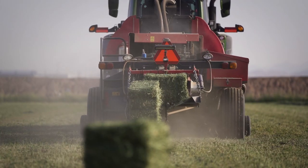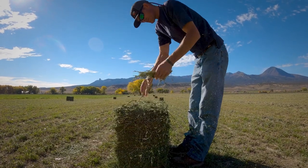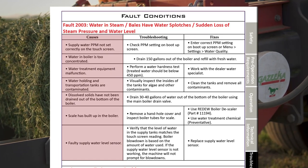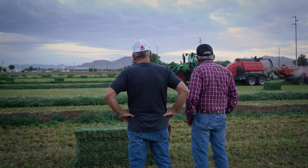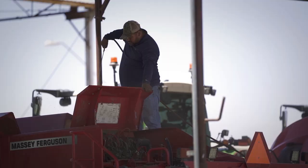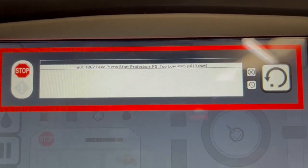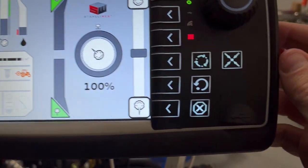Every so often, visually inspect your bales to ensure you are getting the desired effect. When freshly steamed bales come out of the baler, they will feel soft and spongy — don't worry, the bales firm up as they cool down and they stack excellently. If dark spots or wet flakes begin to appear in your bales, consult fault condition 20003 in the owner's manual to find the possible causes. Remember that you are responsible for how your bales turn out. When you are finished baling, perform the post-operation maintenance: purge steam through the baler hardware nozzles at 100%, then clean off the steamer and baler with compressed air. If a fault appears, look it up in the owner's manual and try to resolve the problem. Call your dealer if more expertise is required. Once a fault is resolved, reset the fault by pressing the reset X button.